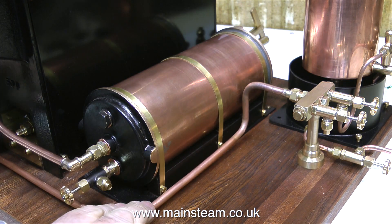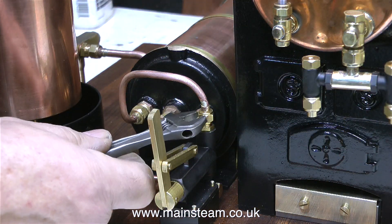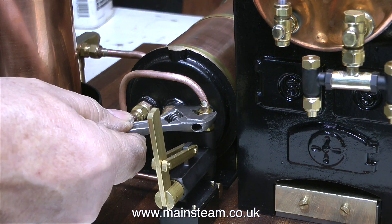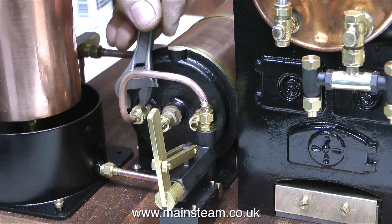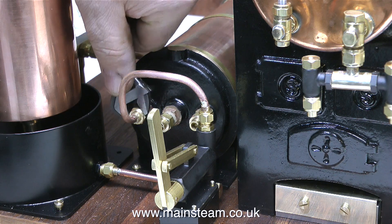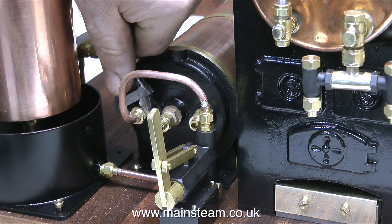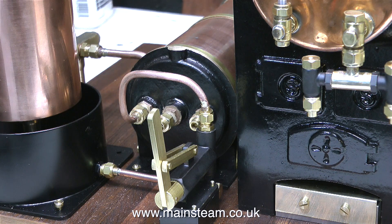You can see here it's actually touching the condenser. So after finishing this part of the video I removed the pipe, heated it up, removed the pipe union, cleaned up the end, put a new pipe union on and re-silver soldered it. While I was in silver soldering mode in the outer part of the workshop re-soldering the main steam feed pipe, I made this one as well.